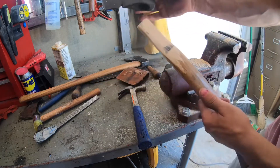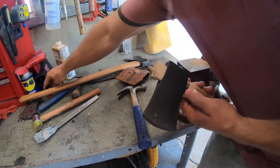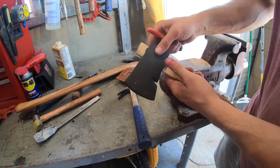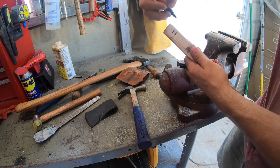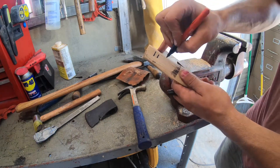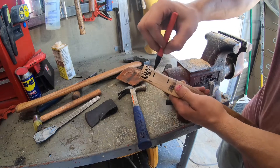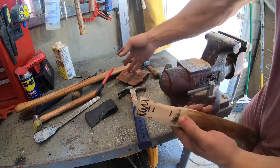Let's get this hung and then finish shaping the handle, because the handle's pretty much done — I just need to get the foot sorted. It's seated right there, so I'm gonna mark where we are and cut it off right there. That's where our axe head will start roughly, so we want our wedge to be about two-thirds down. So we're gonna do a kerf cut down to about right there — that's the plan.